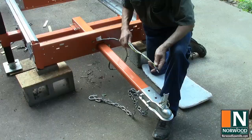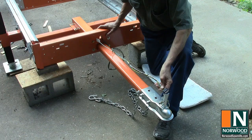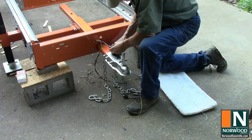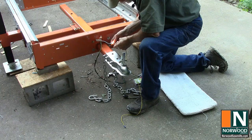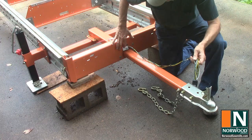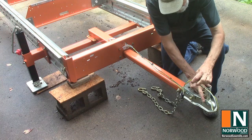The ground wire is too short to reach the vehicle connector when the tongue is extended to the towing position. So, splice in the 24-inch yellow wire you just cut off to make it longer. I'm using heat shrink butt connectors, not included. Now with that splice in the ground, it will reach from the frame to the end of the tongue to the coupler and have a little bit of wire left over just to make sure that it'll reach the connector